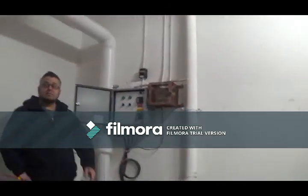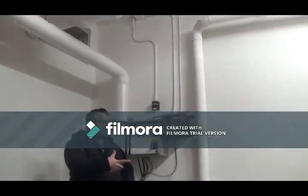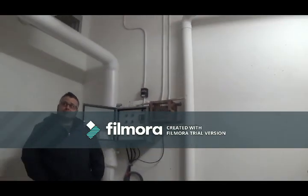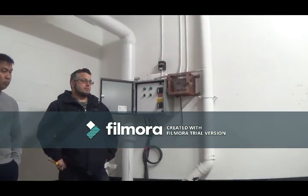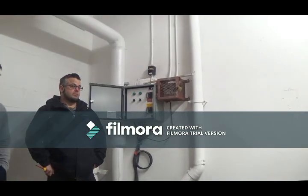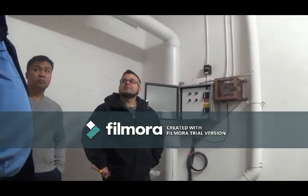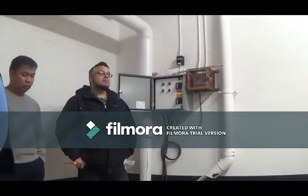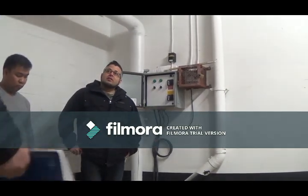The debris comes. Now, the floats, are they all attached to the inside wall of the sump? Either on the discharge pipe, which is steel, or there's a special piece of steel rod. They're separate. Yeah. And they use a stainless steel gear clamp with a piece of plastic, and it should have 6 inches. Excellent. As soon as you say the gear clamp and PVC, that all works for me. I know exactly. You don't want to go in there with a mess inside. You're going to do it right the first time. Exactly. Because otherwise we end up trying to sell it after, saying if you put a float in, we have to pull it out. Nobody wants to go down to the pit.